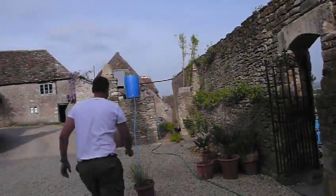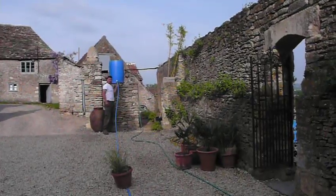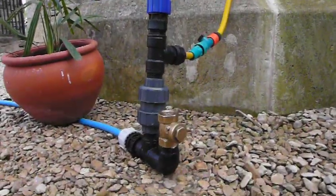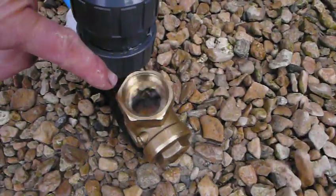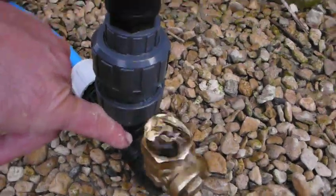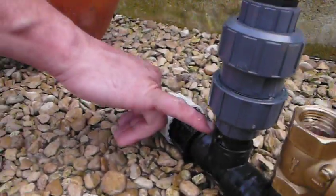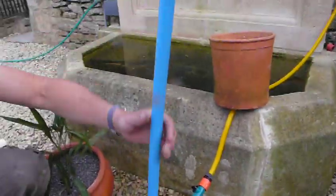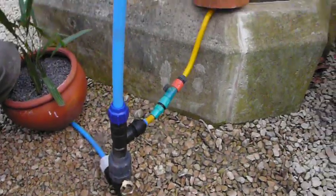This is a bit of a small flow. Anyway, we're going to fire her up for you. Turn her on, turn the valve on. Now she's starting to pump. If you have a good look, you can see the swing-check valve — if you come over the top of here, you can see the swing-check valve shutting. And you can see here there's a little water squirting out the snifter — it's sucking air in. That's the pulse. Now we're going to turn her on here, because we're pressurising this vessel and she's ready to go. Here we go, turn that on.